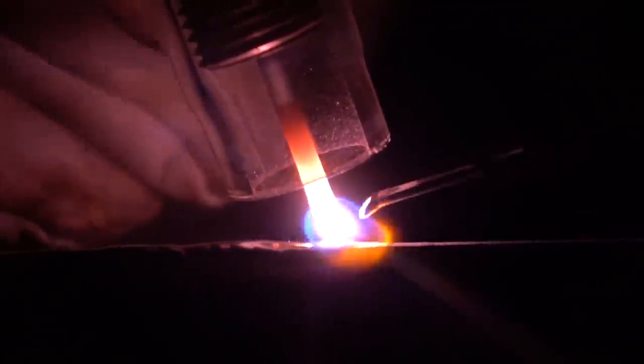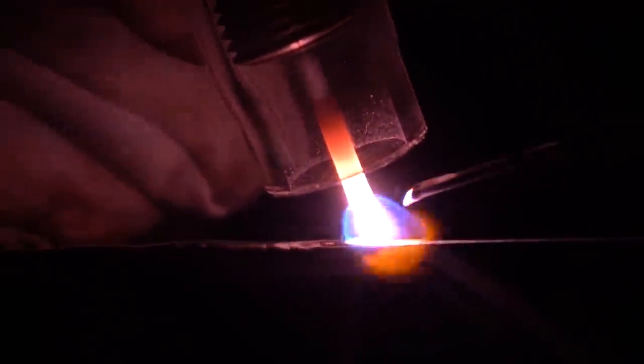Let's start with some basic settings — the soft square or soft rectangle wave, no offset, 120 Hz. Look at how ridiculously smooth this thing is. This is 80-thousandths aluminum and I'm busting out a perfectly controlled edge weld on it — about two millimeters thick. This thing is absolutely crispy and beautiful on the AC side.